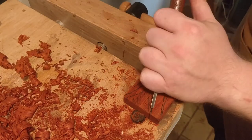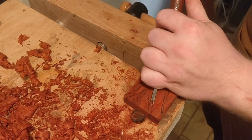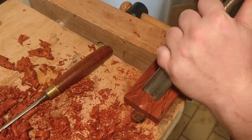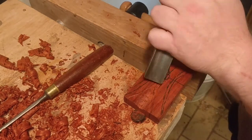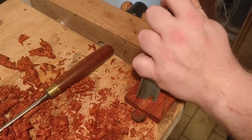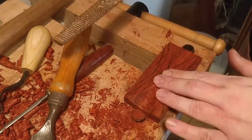To start with I just took off some material with my chisels — my carving chisels, also freshly sharpened on my new Tormek — and here it's sped up to help you see it. I was very careful because this is my first bowtie not to take off too much material, and instead leave more material to work with the rasp and file. All in all I spent about an hour using rasps and file because I wanted to be very gentle with it. Even here in the initial shaping I used an old rasp just to get a good feel of where we're going.